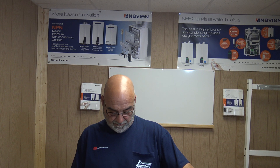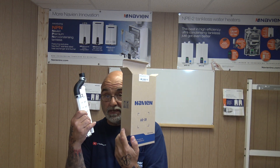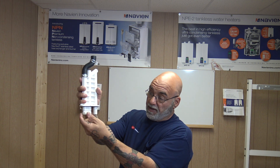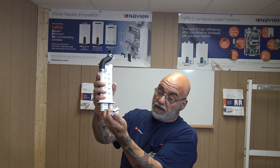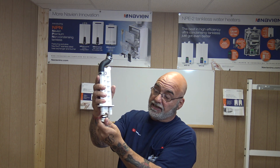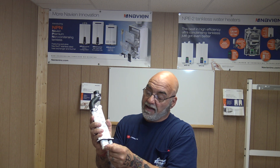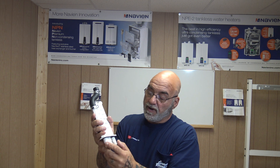All right, so this is your trap. You can get it extra — it has part number 300-249-21A. That is your trap, and this comes in the parts kit from Navion. Once you pull this little stainless steel pin, you pull this out, and you can drain and clean out the condensate trap. You can also replace this — comes in the little parts kit within the unit. You have a new O-ring for the condensate; you squeeze this, push it in, Bob's your uncle, you're back in business.